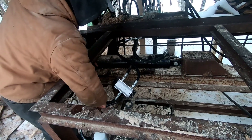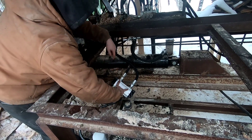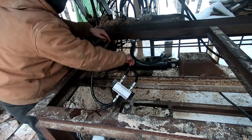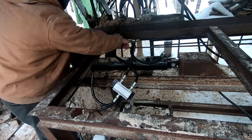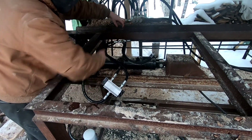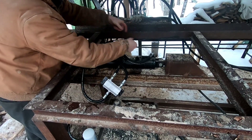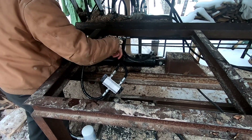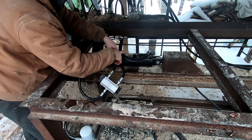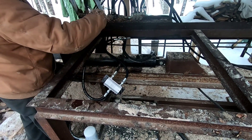And when it's coming back, the flow returns and splits — so only half is going back in the return line. The other half tees back in and continues the flow. The T is just kind of meeting the two. So I'm getting an extra half flow — the full flow is coming in and I get an extra half flow this way.